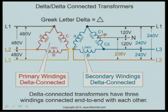For this example, we've chosen to take the secondary winding and connect phase A to C, connect C to B, and B to A. You have three different transformers with four wires — two on the primary and two on the secondary. You take the three transformers and put them together.